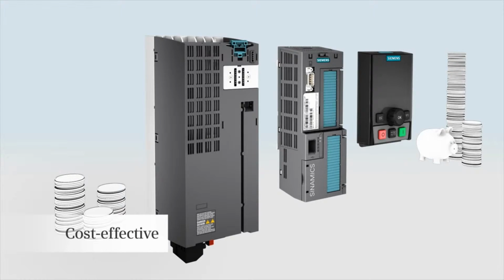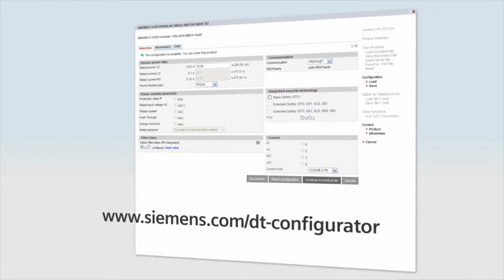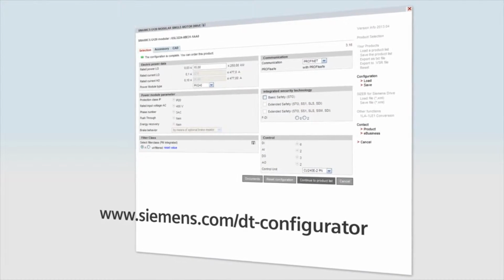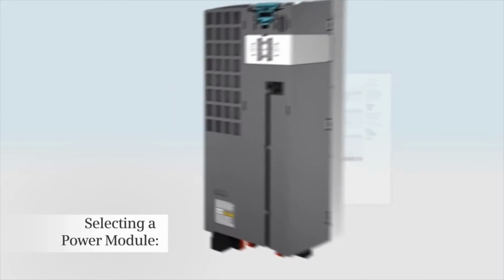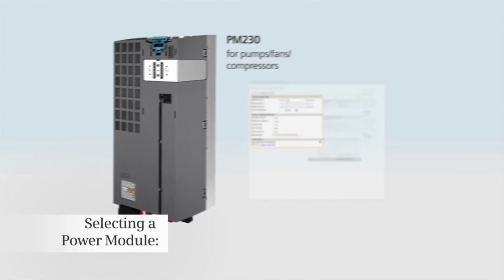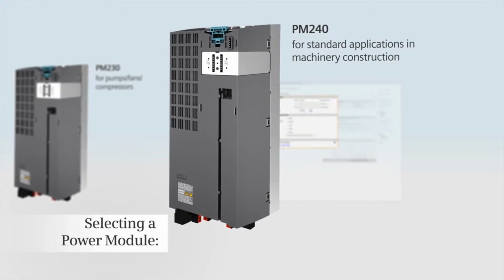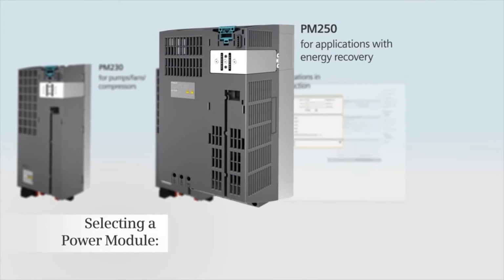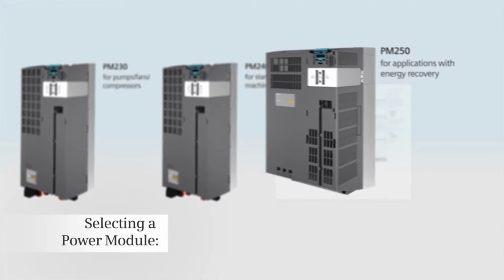However, how do you identify the components that you require for your particular application? You can configure your SINAMICS G120 with just a few mouse clicks using the DT Configurator, our online tool. First, select the optimum power module. Select a PM230 if you have a pump, fan, or compressor application. Select a PM240 if you have a standard application in machinery construction. Or a PM250 for applications with energy recovery, for example, in conveyor technology.